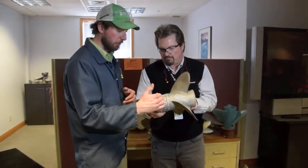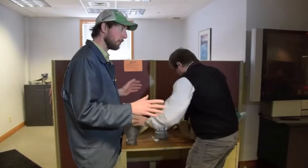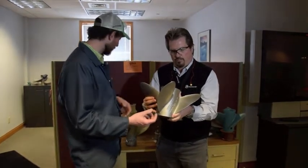This is the casting and the pouring cup. We'll cut the pouring cup off right at the filter line, and then we'll start polishing it. We'll do a stainless steel shot bead blast first to remove the chrome oxide layer, then you'll be left with this finish. We'll chisel out any ceramic that's left, and then we'll start machining on it.